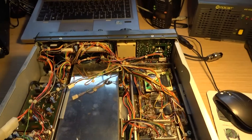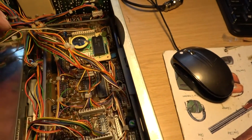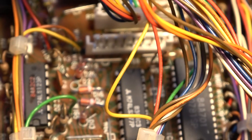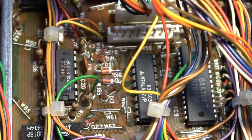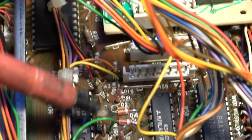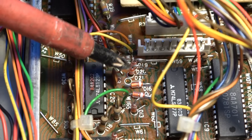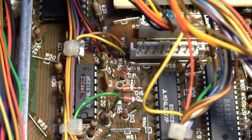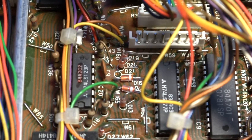This is the bottom of the unit. It's all lovely old technology, very easy to work. I will check the backup battery as well, which is advisable to do. The actual diodes we need to look at — D21 is not fitted, which I need. So currently I've got D19 and D20 fitted. D21 is what I need, so I'm going to have to move one of the diodes across. I'm going to move D20 into the position of D21, and then that should give us the 12.5 spacing.